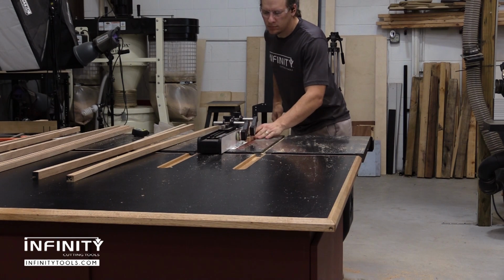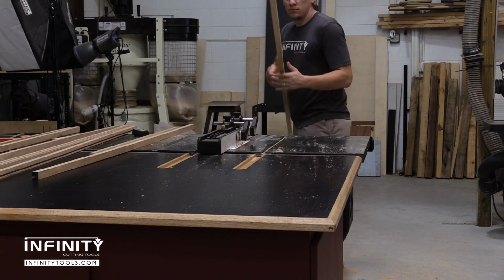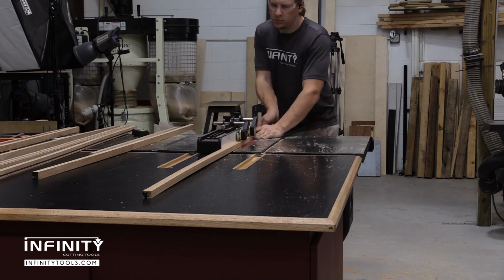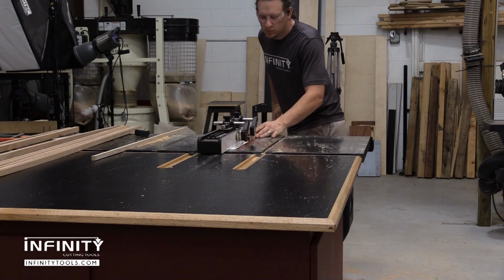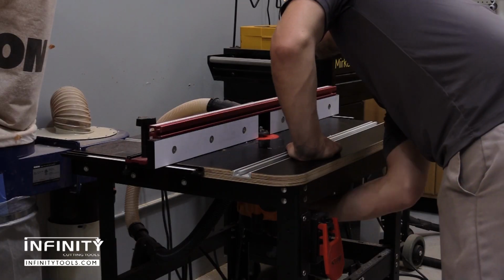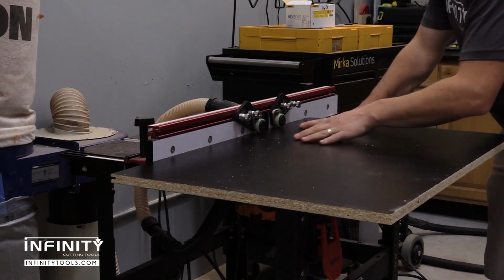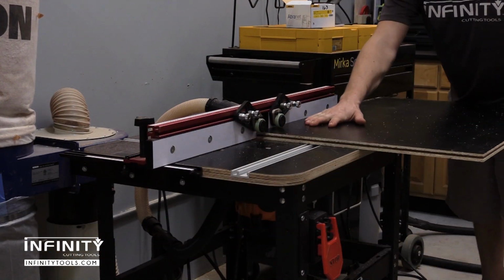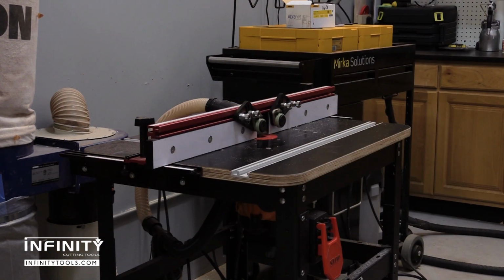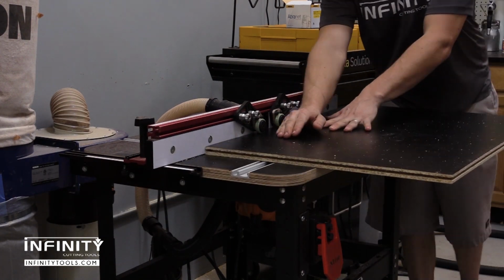little bit extra work. Then I switched to a quarter kerf blade and milled a groove in one face of all of the edge banding strips, and that'll accept a spline. Then it's over to the router table, and with a slot cutting router bit, 1/4 inch kerf, I cut a corresponding slot in the tabletops that'll also accept that spline for the edge banding.